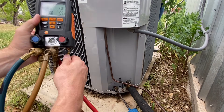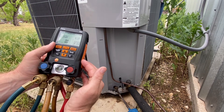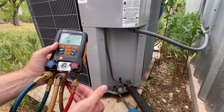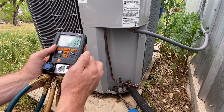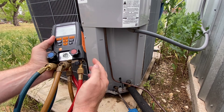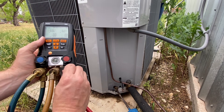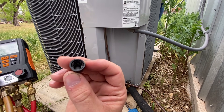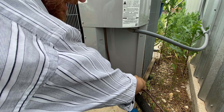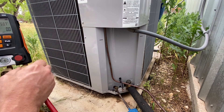Now I'm going to unscrew this — a little bit of vapor came out, no big deal. I have this vapor in the hose and I don't want to leave it there. If I put this hose in the truck and the temperature gets high and the sun shines on it, the pressure is going to go up, push on my sensors, and can bust my gauge. So I'm going to use a de minimis release. We saw a little bit of oil come out but it's just vapor. Now we're at zero psi gauge. I'm going to take my other valve cap, check that there's a rubber o-ring in there — and there is — and put it back on. In the next video we're going to talk about these valve caps — there's a lot we need to know about them, and I do not like these plastic caps.